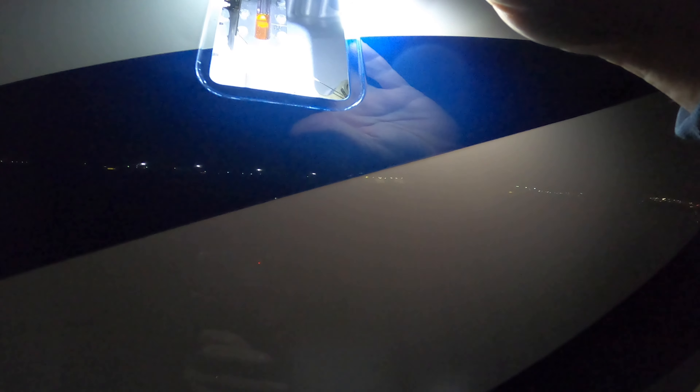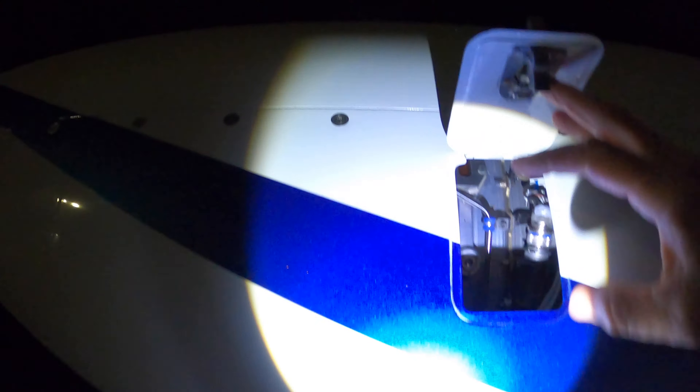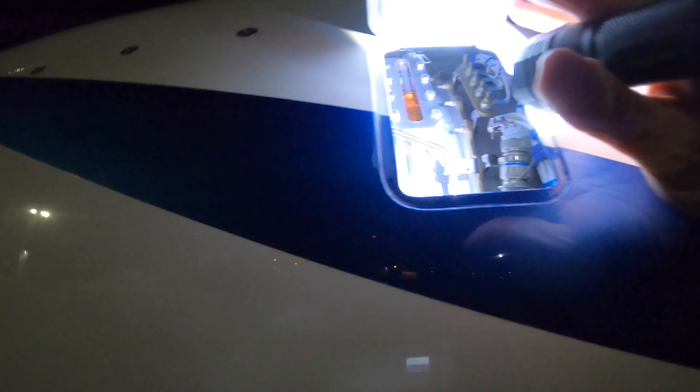I like the oil between that bottom bolt and the next bolt — somewhere in there is good. Once it gets down to that bolt, not to the add line but to that bolt, I'll fill it a little more. It's got like 10 or 15 hours on it with no oil added. These things really don't use much oil until they get really worn out.